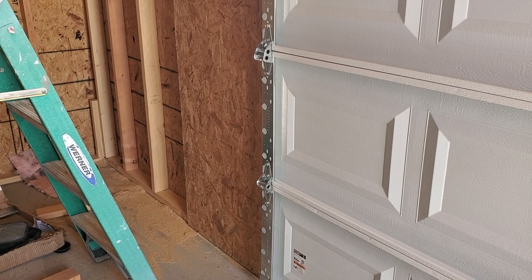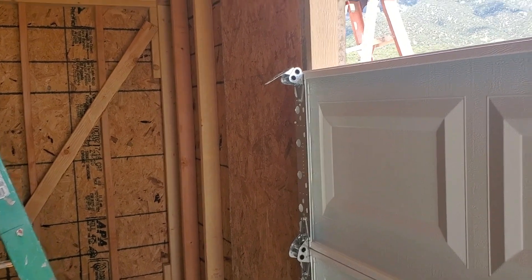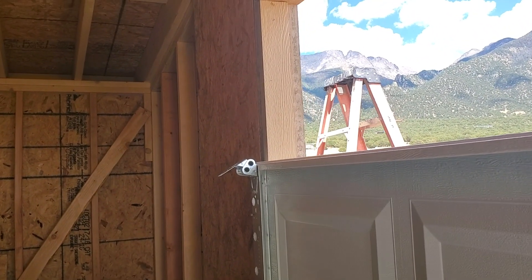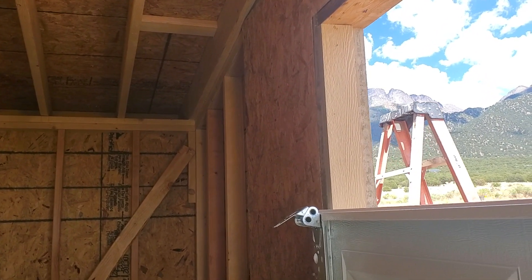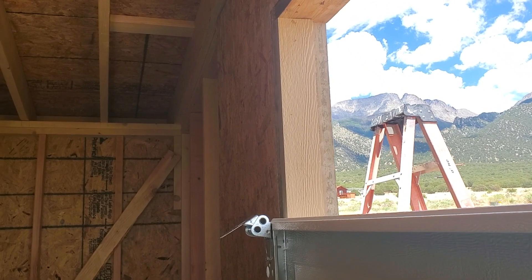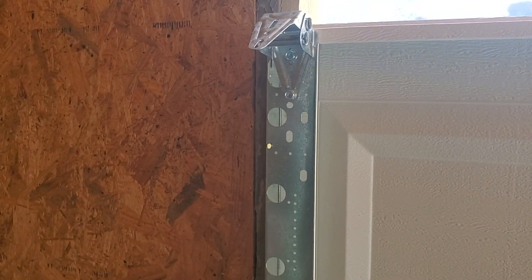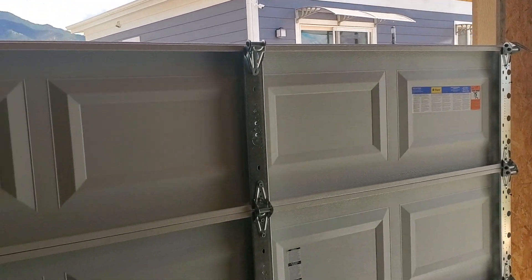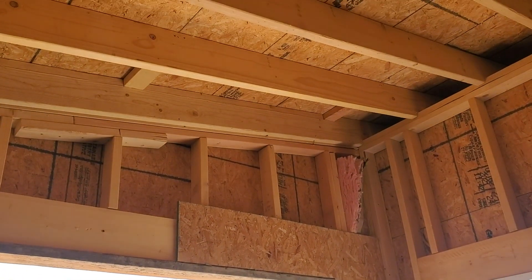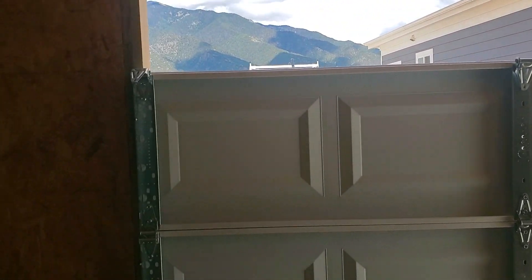It's going pretty quick now. I went ahead and put the fiberglass insulation in the wall, put my sheet of OSB on. To make it a little skinnier around the opening, I put a 2x6 flat on the inside — it sticks out a little bit but I'll cover that with trim. On the inside I put a 1x4 to have something for the edge of the door. Everything's held up with little nails. I'll get the top piece on there, put the rails on, and that part should be done. And I didn't mess up the rough opening of the door — so that's always a good thing.